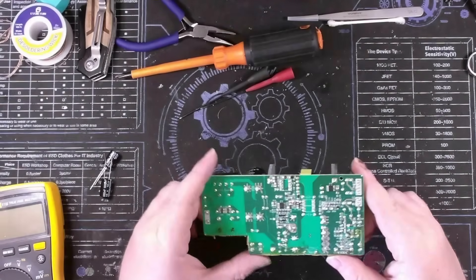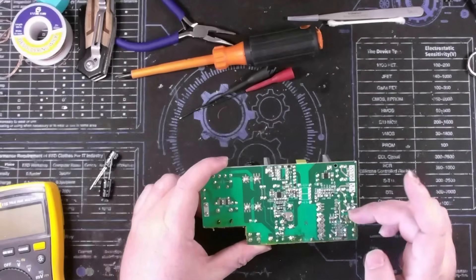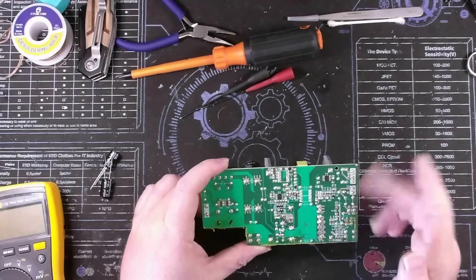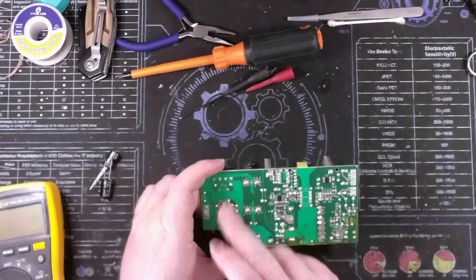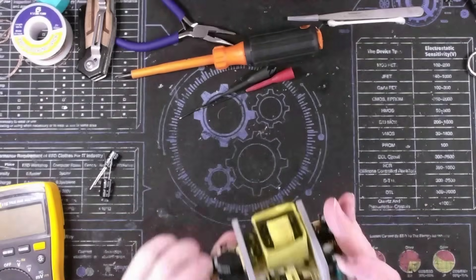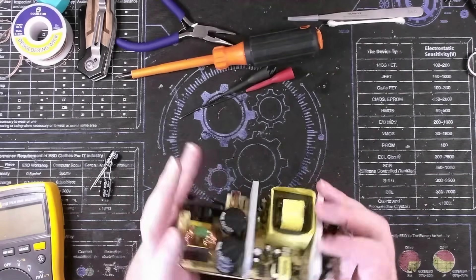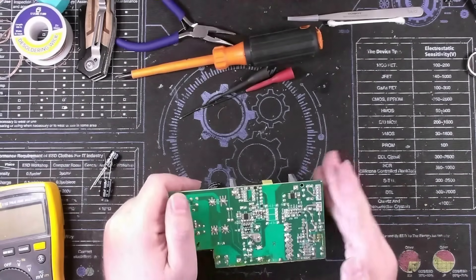When I put in power I should be able to see rectification come through here, and that should be fine. This is a switch mode power supply, so you can see there's separation between basically the switching side and then our low voltage DC side and high voltage DC coming out. With all switch mode power supplies you have AC/DC rectification, step up or step down through a transformer - you got this transformer right here.